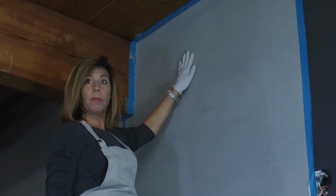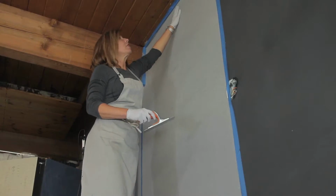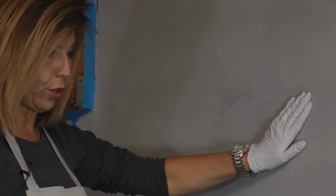So before we actually begin to put this finish coat on, I run my hands over and we like to feel it, make sure that there's no high areas, because we'll knock them and then we'll end up getting hitchhikers. You'll get the hitchhikers and they will create the scratch marks in your plaster. So you end up doing this all over your wall.